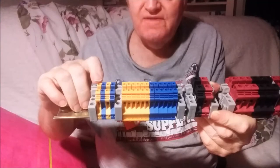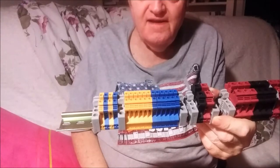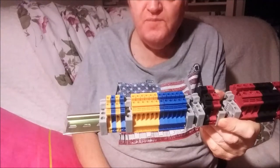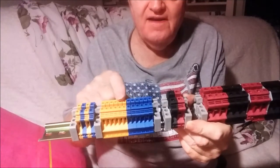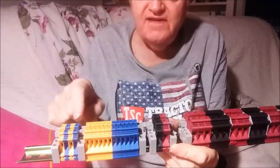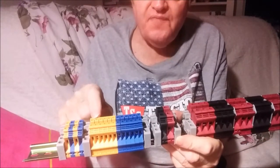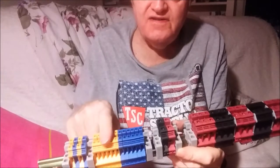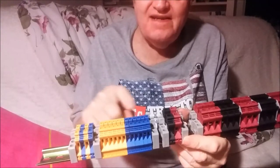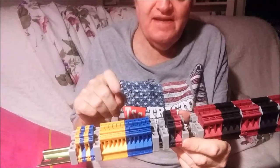Next there's a dedicated breaker — that's your 4th breaker — for future split air conditioning. That's the 5th. We've got 2 more breakers, so 2 dedicated circuits down here rated for 32 amps. That can be a refrigerator or uninterruptible power supply for a computer. So these groups here get jumpers across — I've got 6 on here.